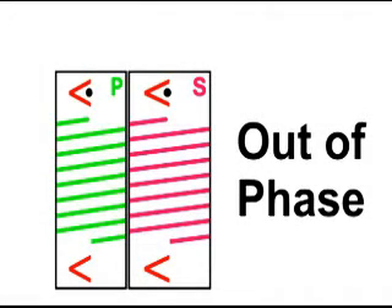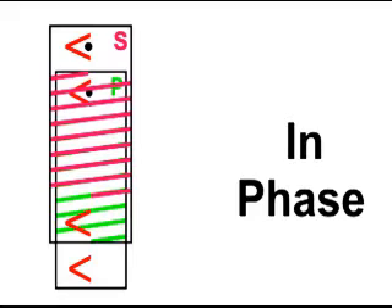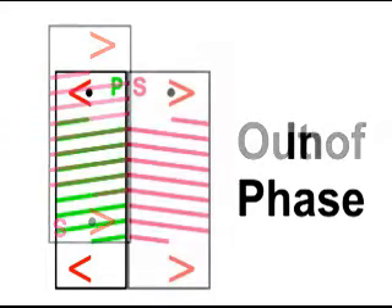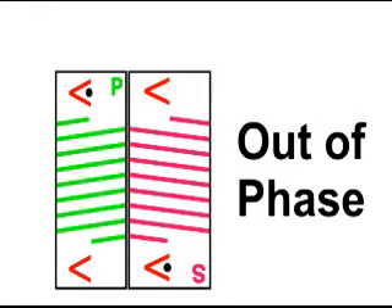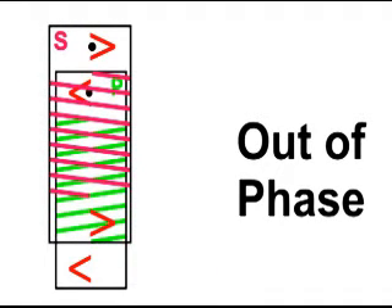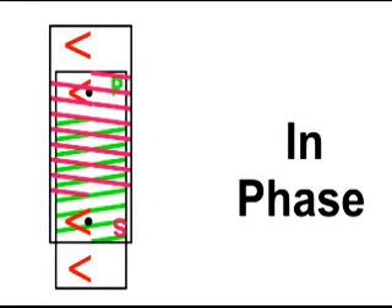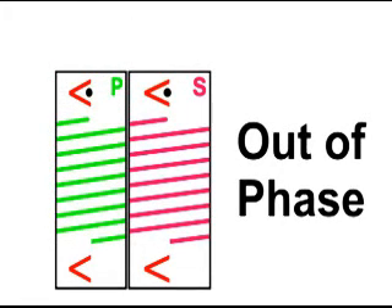In the more information section of this video, that's in the upper right-hand corner, I have a link to these pictures. I've drawn eight pictures that depict all eight scenarios shown in this video. So if you have a need to rewind a coil some day, you have to pay attention to how the coil is wound, the gauge used, and the number of turns.